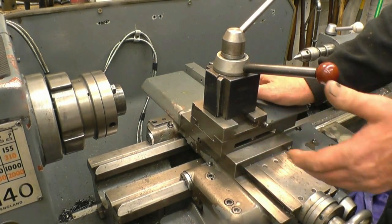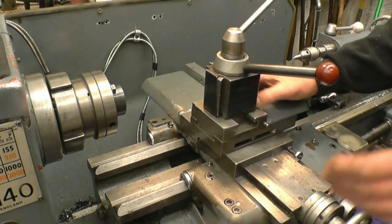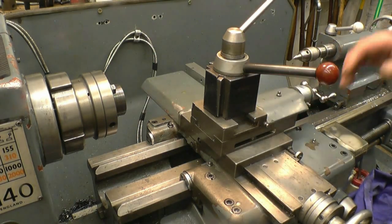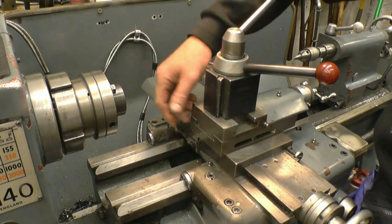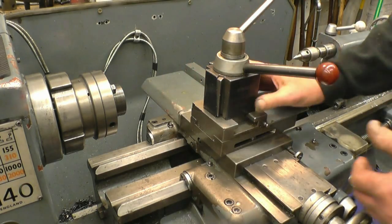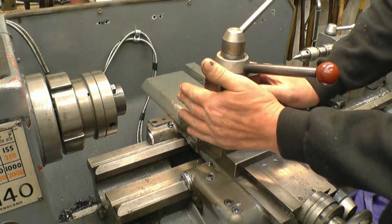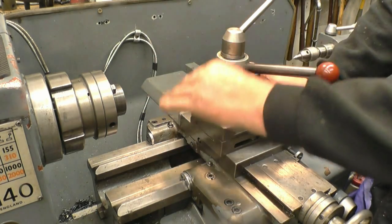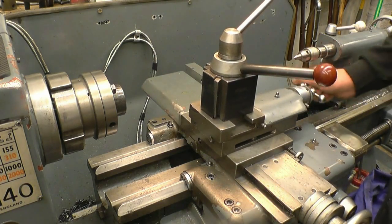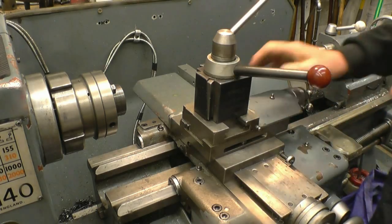In the first part of tonight's video I was going to demonstrate how you can mill a slot in a piece of bar using the lathe — and you can break cutters in a lathe just as well as in a milling machine. All you do is mount the milling cutter in the lathe spindle. What you would normally do is take the tool post off, put an angle plate on there and clamp the job to it, or put a vertical slide on so you could move the job up and down. For now I can only move the job across and control the depth of cut using the top slide, locking the main carriage off.